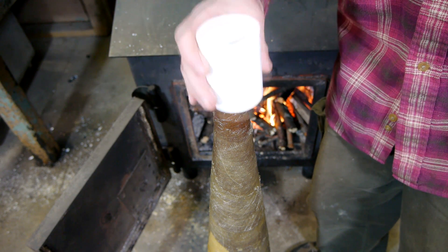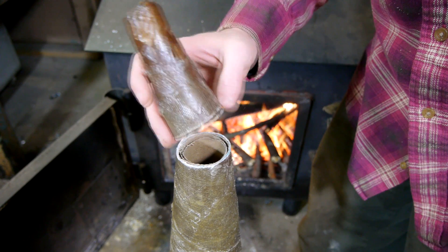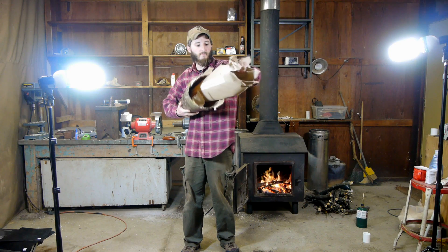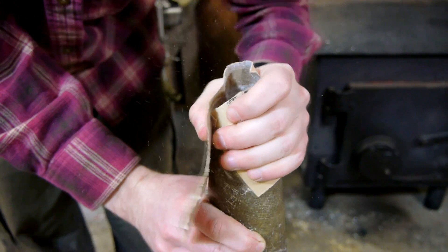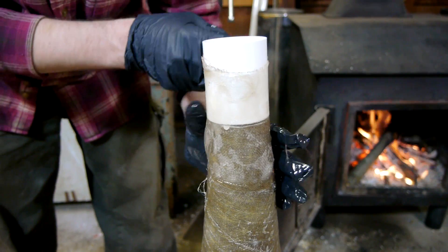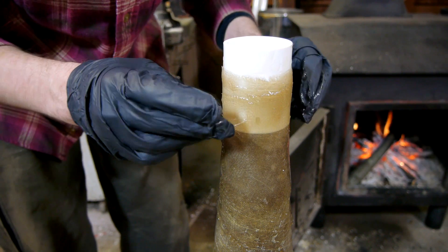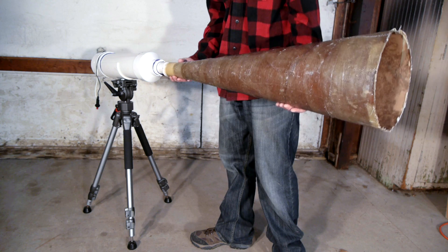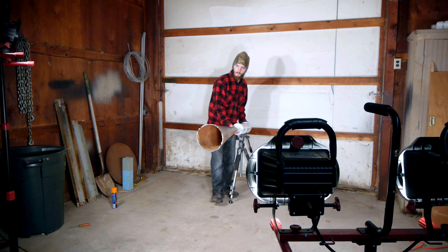The cone will mount with a 1.5-inch PVC coupling. Now that the resin has had time to cure, I can trim off the top of the cone so it transitions to the fitting smoothly. I'll use sandpaper to rough up the outside of both items, and a few strips of fiberglass wrapped around the joint to turn the two pieces into one. The vortex cone can then attach to the chamber by slipping over a short length of 1.5-inch pipe that has been glued into the chamber's reducer.